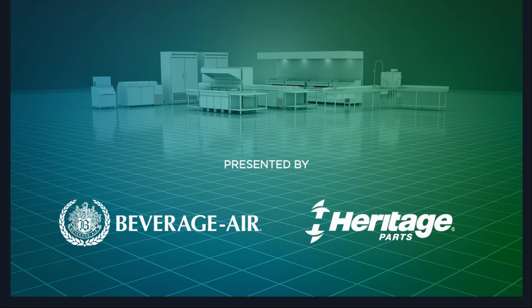I also see a question, what scales do you use to measure the charge, and do you sell a kit for the repair? So yes, we do sell a kit. There is an R-290 tank charging scales. Those are available. We do not supply those. You can use a standard scale, digital scale set. You just have to be very delicate with it because, once again, this is just a 14-ounce cylinder.